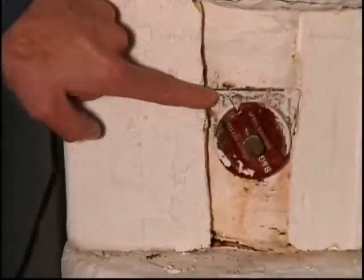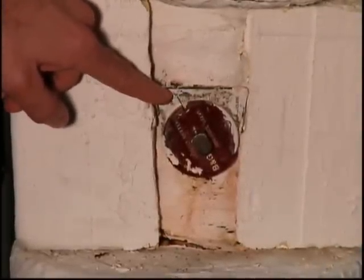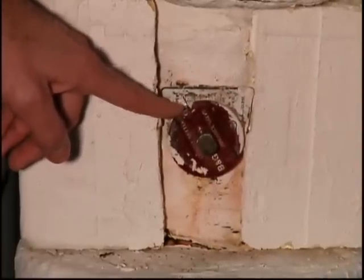If we're going to move that valve, we want to mark where it was on that scale — either make a little mark or make a note — so we can get back to that position. Right now we know it's wide open, so in a little bit I'm going to throttle the pump and we'll just bring it back to full open when we're done.